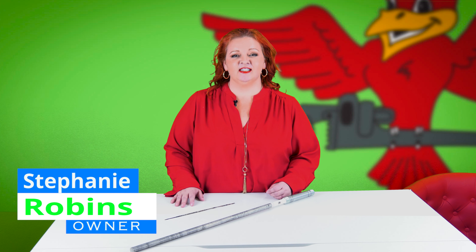Hi, my name is Stephanie Robbins. I'm with Robbins Plumbing and today I want to educate you on how you can drastically extend the lifespan of your tank-style water heater. Whether you have a gas water heater or an electric water heater, there is a very key component that can affect whether that water heater lasts four years or 24 years — and it's water quality. There are two main reasons that water heaters leak: water quality and pressure.